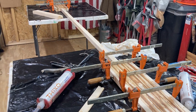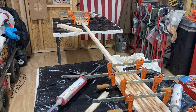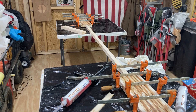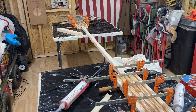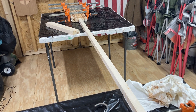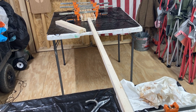To get to where we're at today, we went and got two spruce two-by-fours, eight feet long, at the local lumber store. They had number two select grade — we would have preferred number one, but we didn't see a pile of that anywhere. So we picked through a few boards and found the best we could, trying to minimize the big knots or loose knots. There are a few little pinhole knots, and we had plenty of clear material to work with.